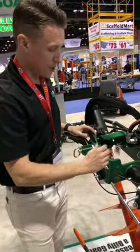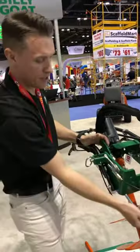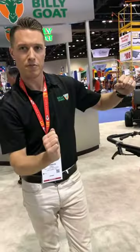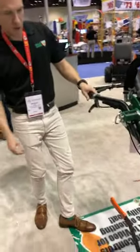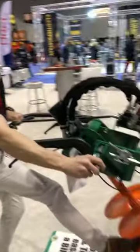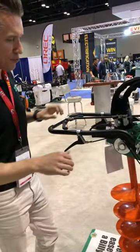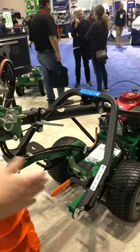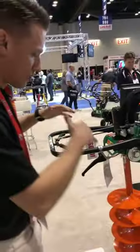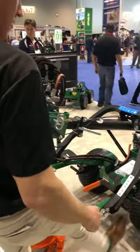It also has the ability to be rotated to drill on the side of a hill. There's a pin here you pull and pop it down into a slotted internal receiver. As I loosen that, it can rotate my head over left and right, lock it down, and drill. When I am drilling a hole and I want the machine to sit still — because it does get a little violent motion while drilling — we do have a brake that locks the tire on either side. That will enable the machine to not move while I'm drilling the hole, keeping me firmly planted right where I want to put my hole. Easy to release.